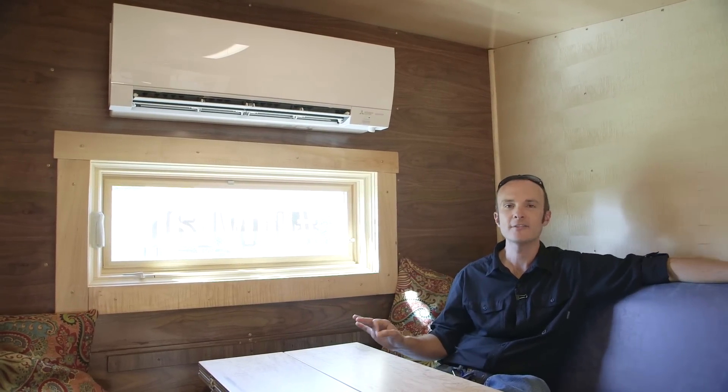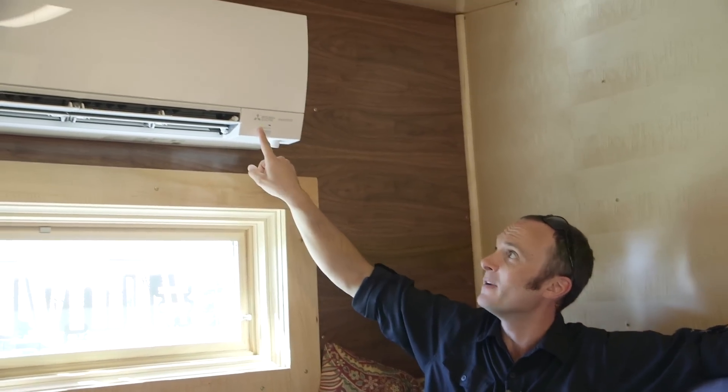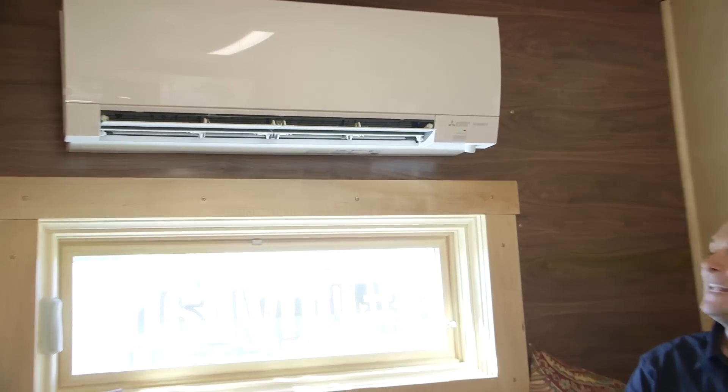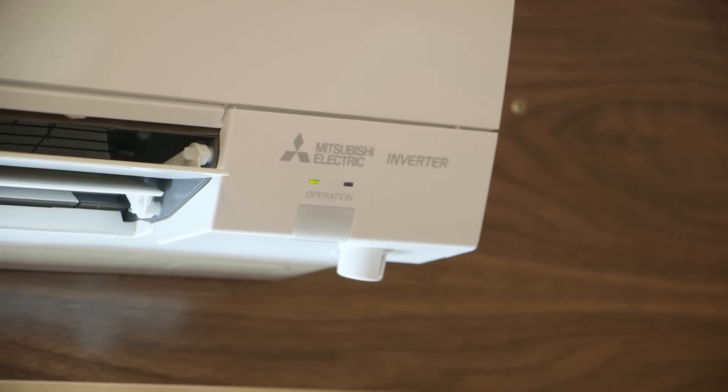Mission accomplished — cool, dry house on an 85-degree day. This air conditioner is running right now and makes no sound whatsoever. Right underneath the green light you can see this little sensor, which is spinning back and forth — it is the infrared IC sensor that is scanning the room to find all the hottest spots. It will change the vanes' directionality and send cool air to where it is needed most. In wintertime it reverses the process and sends heat to where it's coldest. I hope that seeing how our HVAC system was installed and tested really helped you. You can come see this thing for yourself on the Proof is Possible tour at proofispossible.com. Subscribe to our channel for new updates on home performance.